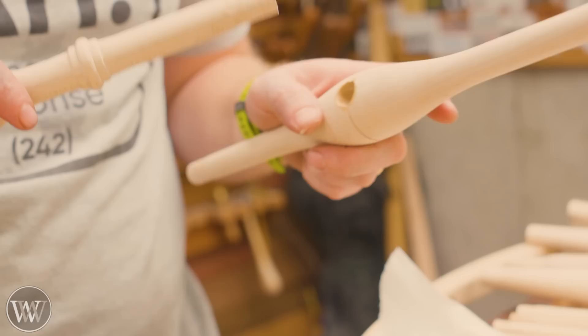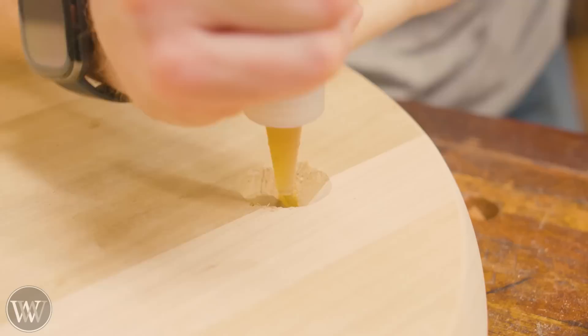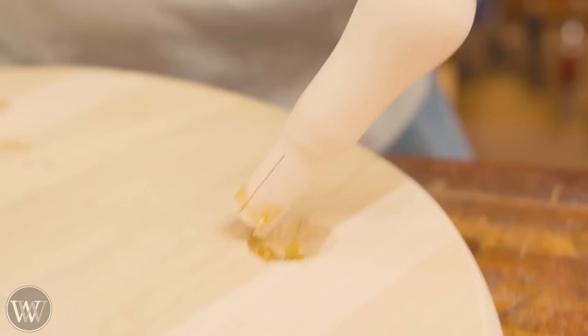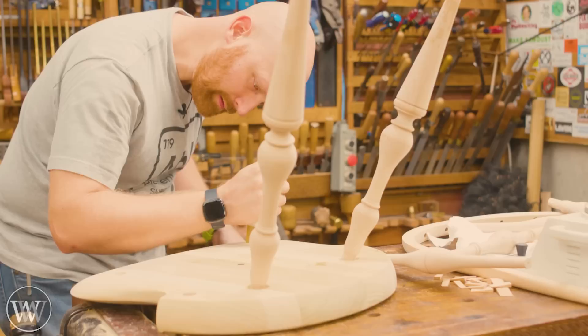You could use a brush to put it on a little bit better. I do want to do a dry fit on all of this and make sure I know exactly where all the pieces go before doing the final assembly. And then when it comes time, you spread in the glue and drive it all together. One of the nice things about hide glue is it finishes transparent. Most of the time with a chair, I try and do the finish first and then put it all together, and that way it's so much easier to work on.